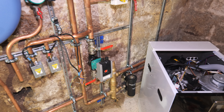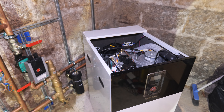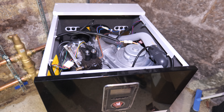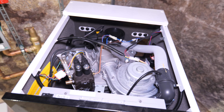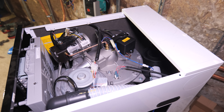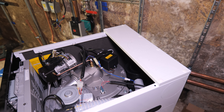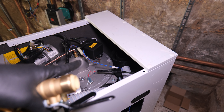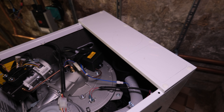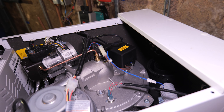For those of you that have watched our previous videos, you'll have seen we've fitted quite a lot of these Navion oil boilers recently. This one's slightly different because it's an internal version. We normally always fit the external version whether we're inside or not — I prefer the colour and they have a bit more noise insulation — but in this case we've got to go directly up and the external version doesn't allow for a vertical flue unless you bring it out the side first. On this internal version we can just pop through this knockout here. We're at the very limits of how long we can have this vertical flue so I don't want to push it any further than I need to.